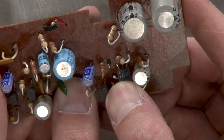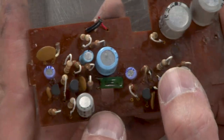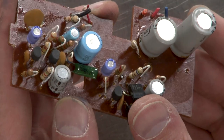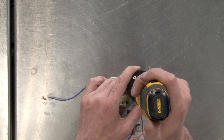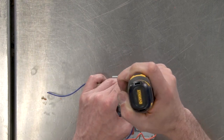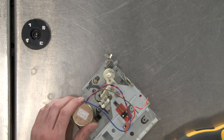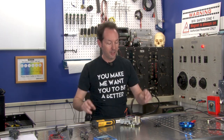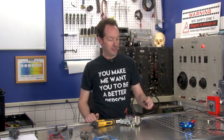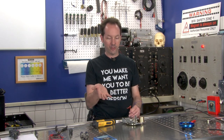There's your identification. I think it would be really cool if somebody actually built this. So that's the circuit board, and that pretty much does everything. Now, this is our channel indicator — you'll see there's four channels. The way it works in an 8-track player is you have eight tracks in stereo pairs, so you have four sets of tracks for channels, and they're all side-by-side linear on the tape. This is which set you're picking. Think of it kind of like how a record had two sides — this has four sides, but it's all in one tape.